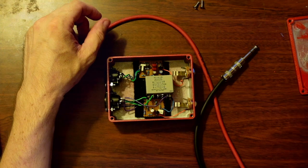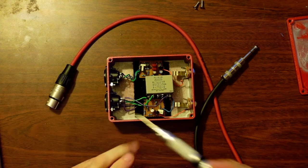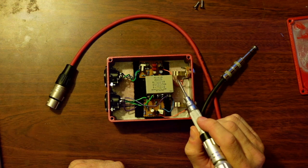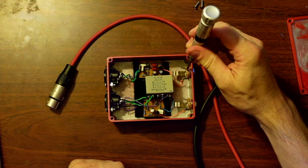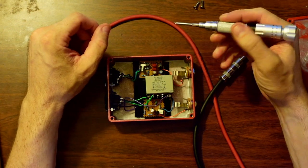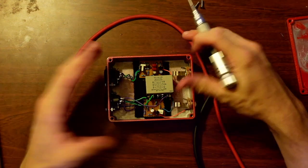We are actually going to draw them. Over here we've got our XLR plugs — these are just for getting a balanced signal out. The way a balanced signal works is that it's noise-cancelling for the length of the cable. One of the reasons for a direct box is just to be able to run long cable lengths without adding extra noise. Over here these are just our quarter-inch mono plugs — we're just plugging in a guitar or a mandolin or something with a passive pickup. The idea is to phantom power it from the XLR plugs so that you don't have to have an external power source.